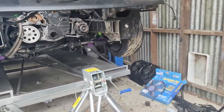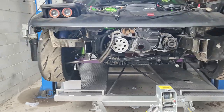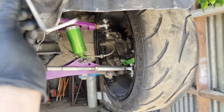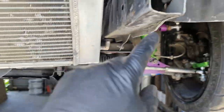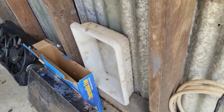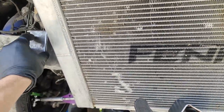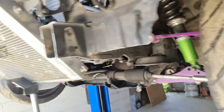That is the front end of my once lovely street car, lopped off. Still plenty of tidying to do, but the next step will be positioning the radiator and working everything else around it. I've got the rails ground back and cleaned up, and made a couple of plates to weld onto the rail for the new lower crossmember or lower radiator mount, and a couple of plates for the ends of the chassis rails with captive nuts so we have something to bolt onto.